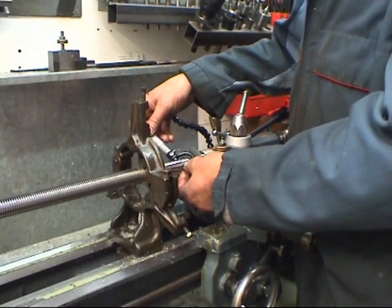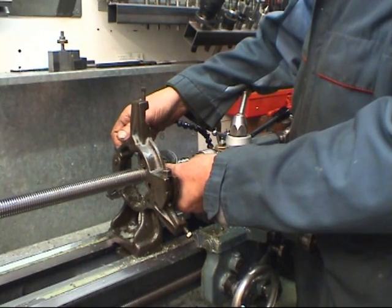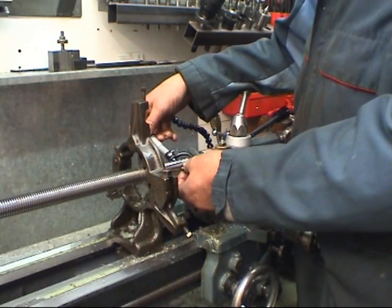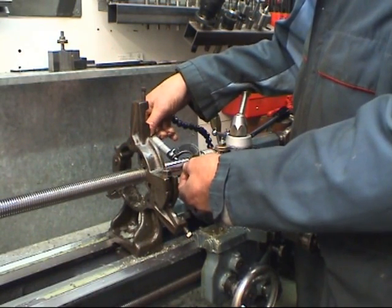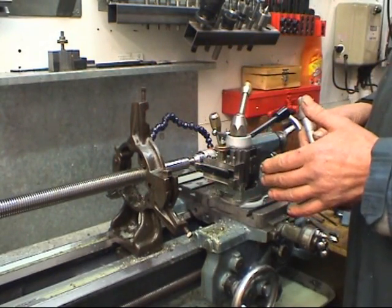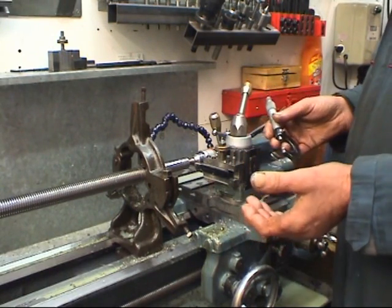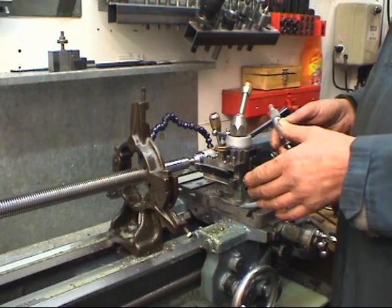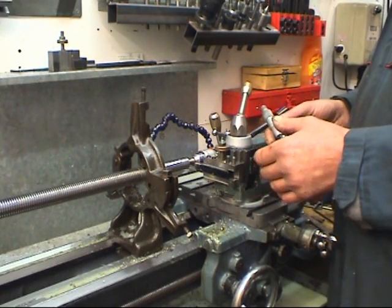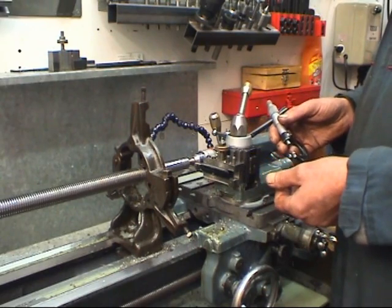Right, we had 15 to go. I took a 5 thou cut, 10. So now we need another 5 thou. I'm going to take another cut without adjusting the tool, just to take any spring out of it. You always get spring. It'll probably take 2-3 thou off. So if I dial in a 5 thou cut, it would probably take 7 thou off. It would be too small.